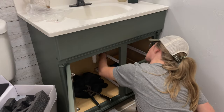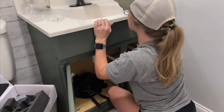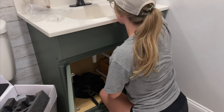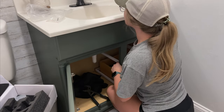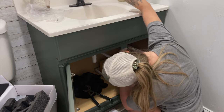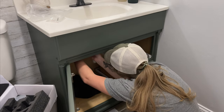After I had it completely installed, I turned the hot and the cold water lines back on and very slowly allowed water to come out so that I could check for leaks, made any adjustments that were necessary, and then had a mini celebration when I realized that I had installed the sink fixture by myself and it wasn't leaking.